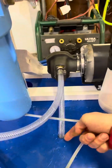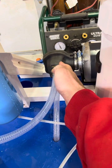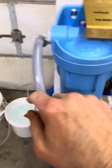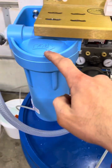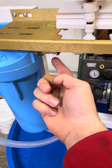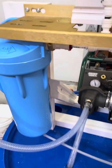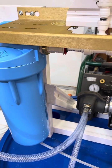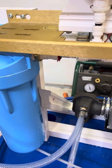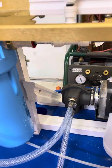Up on top we have the pickup tube coming out of the barrel into our pump. The water comes through a sediment filter, though the fittings on the sediment filter still want to leak after multiple tries, so we'll monitor that and make sure it behaves throughout the season. Since we're sitting right here on top of the barrel, any drips are free to run back in and still get captured.